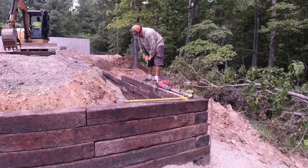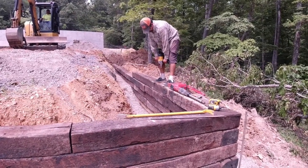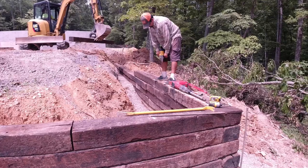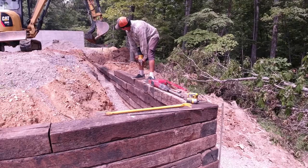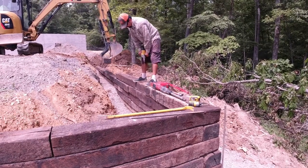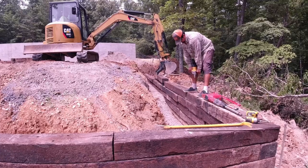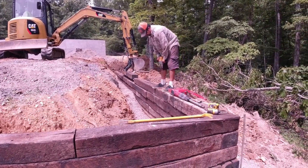What we're doing here is drilling a half-inch hole through both pieces and driving a piece of rebar in there. We don't use the sledgehammer — we've got that big Hilti demo tool that we made into an electric sledgehammer. Pulling the trigger is a lot better than swinging the sledgehammer any day. The pieces weigh about 200 pounds each, so we'll do all we can with the machine.